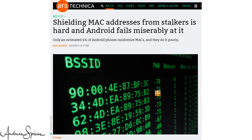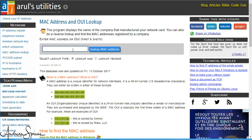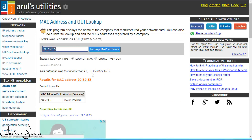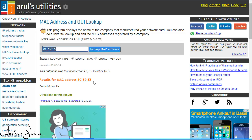I will leave a few links in the description if you are interested in the details. So I discovered the root cause of these many newly created MAC addresses — they all came from my iPhone laying on my bench. But still, it should be possible to build such a scenario, because we will trigger an alarm if any unknown MAC address is discovered. Just make sure that all of your devices are connected to a network when they are close to the sensor, otherwise you will get false alarms. There are two small tricks to help verify such a list of MAC addresses: first, if you run Advanced IP Scanner on your Windows PC, it shows you all MAC addresses of devices connected to your network. And two, the first six places of a MAC address show the manufacturer of the chip or device — take any MAC address and check it with an online service. If no manufacturer is shown, there is a big chance that you checked a randomized MAC address.